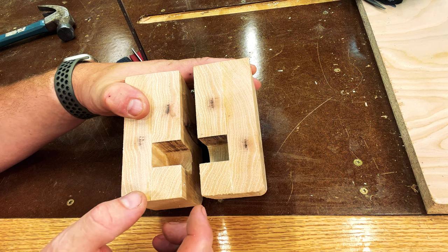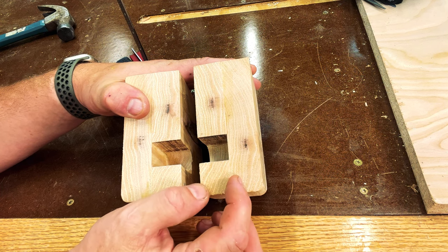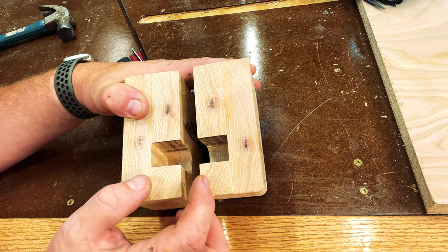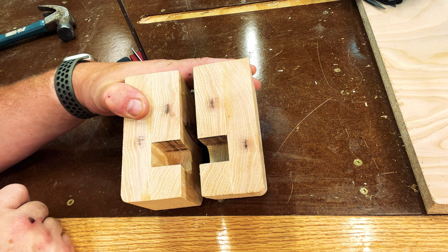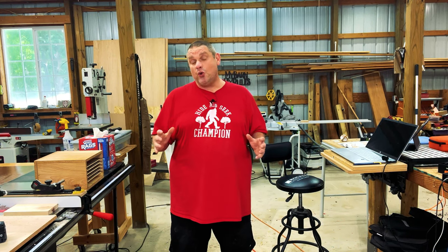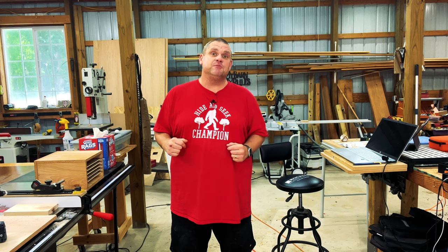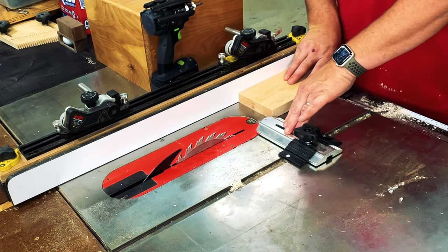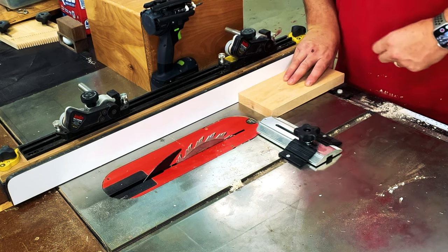Since I used inch stock, you can see there's two hangers both an inch deep. This means if the dowel gets pushed to one side or the other, there's a good chance that that dowel will fall out of the hanger. So what I want to do is create two half-inch wedges that will hold that dowel in place and prevent it from slipping. With the rest of my scrap wood and my thin rip jig set up to a half inch, I'm going to rip two more pieces.